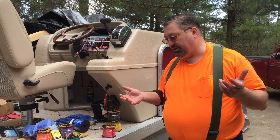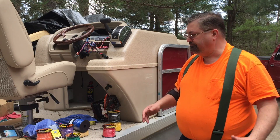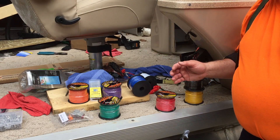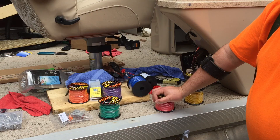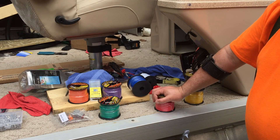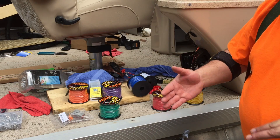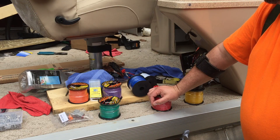I'm going to get into a technical bit of wire repair. To do this, I wanted to keep the wire colors the same as they are in the boat, so I ordered ten different spools of 16-gauge wire and six different color spools of 14-gauge wire. As far as making a tracer, you can use a black Sharpie marker and put the tracer on the wire — that's my intention.